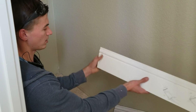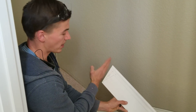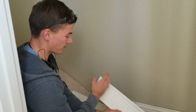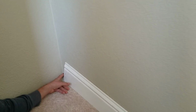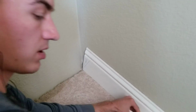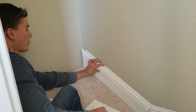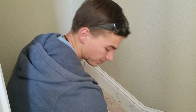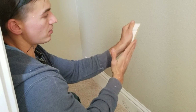So I make this here, again, not at 30, the way I originally did. That messed things up. I cut it back at 15. And if you come take a look, that creates a gap. Before it went right straight up against the wall, the previous cut I did, this one right here. Boom, this one goes right up against the wall. This is a 30, but now I split 30 into 2, and I got a 15. And then I took another piece, and I did also a 15-degree cut.